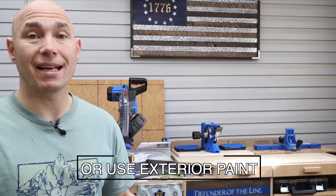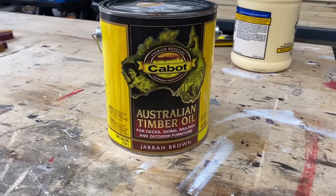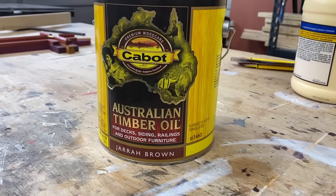So you want to make sure if you're using common pine or any outdoor furniture that you finish it correctly. If you're finishing for outdoor use, you can stain it whatever color you want and then use an outdoor clear coat. I like spar urethane — it's made for outdoor finishes and works very well. You can also use things like teak oil or outdoor wood oil, which you can pick up at Home Depot, Lowe's, places like that.